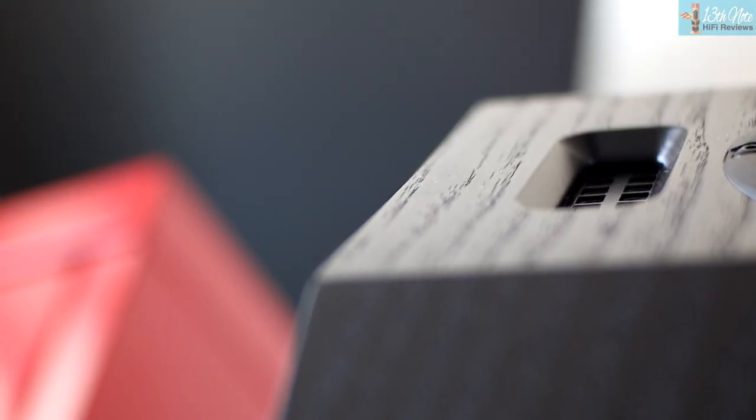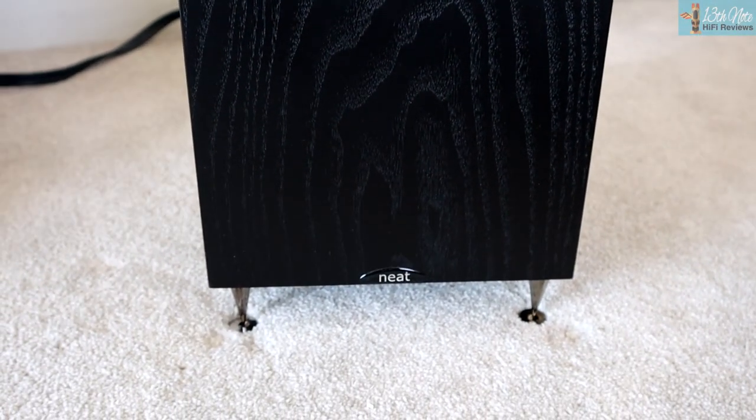These speakers use planar magnetic high frequency drivers, which create really fast and transient treble. They're similar to ribbon tweeters. There are slight changes in the way the diaphragm is designed and other elements in the driver. They're also a rear ported design, so the bass air fires against the wall, hence you've got to have good positioning to the wall not to create too much bass bloat. And the bass driver occupies the lower section of the cabinet, which is partitioned internally.